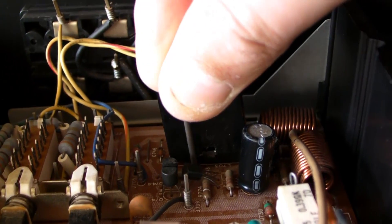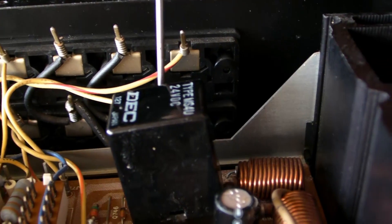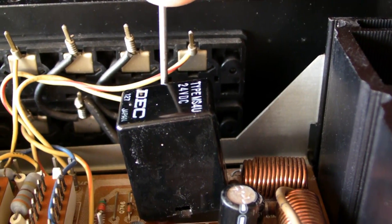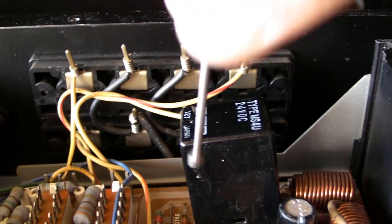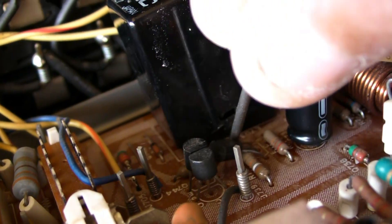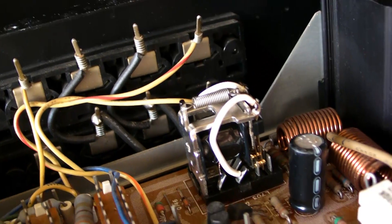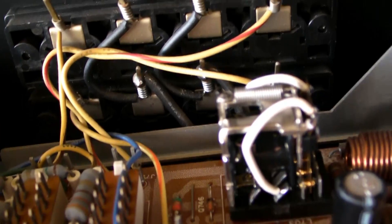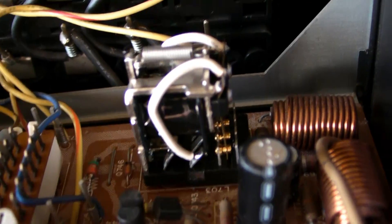You just take a nail and you put the nail underneath here, and then you make this movement. You do the same on the other side, so you work with two nails and two hands. One here and one here - try to put it in the middle. And you just make this motion and do it from both sides, and then this thing will loosen. You take it away and there it is - the speaker relay. Most amplifiers that have a sound problem are caused by this thing.